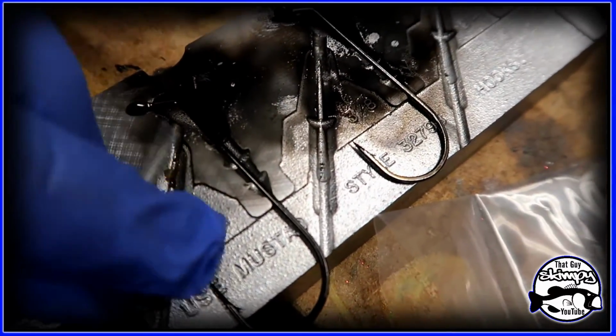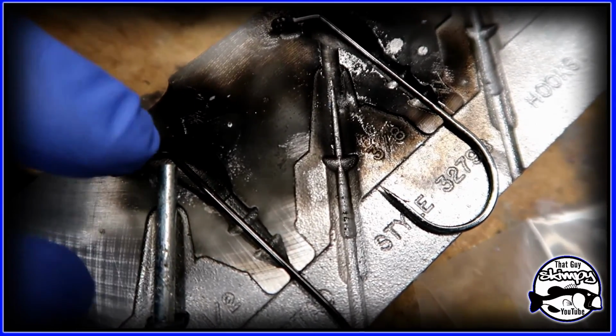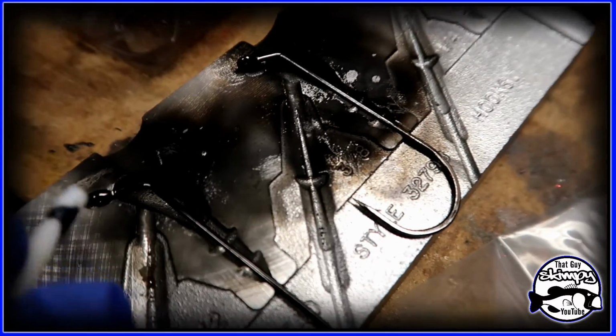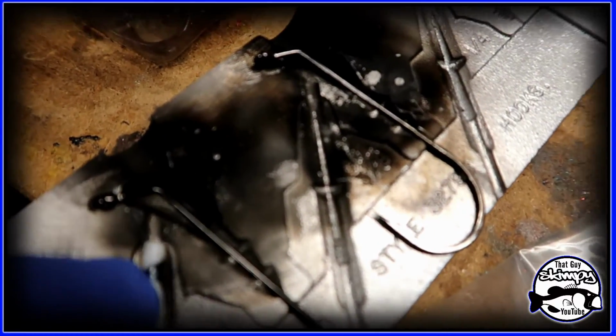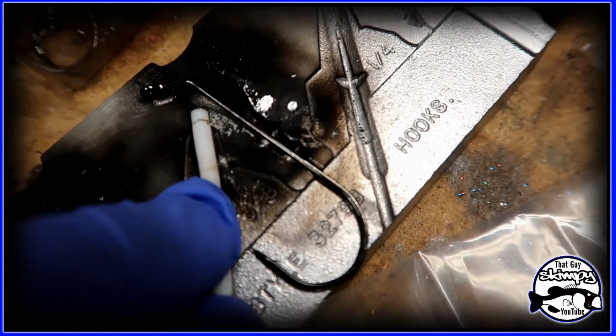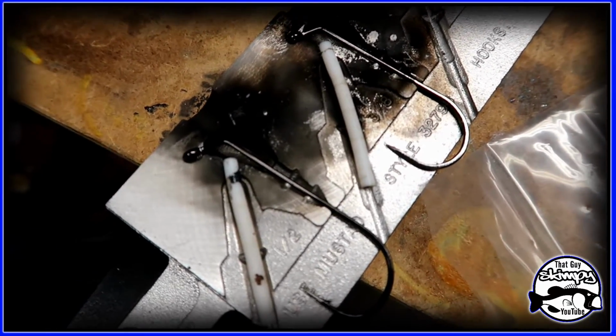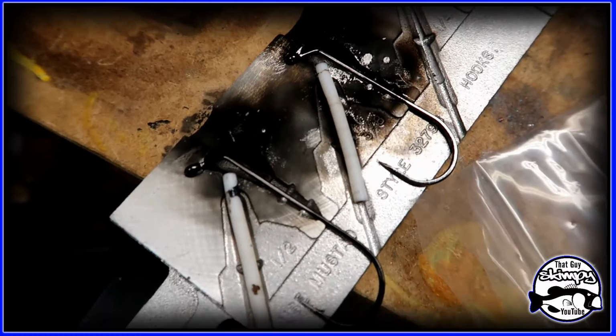You don't want to make it weedless, so if you put a pin in, it's going to go all the way into the jig, and it's going to make a hole to make it weedless. So we don't want to use that. We want to go ahead and use these Teflon pins, and you can slide it back. And what I do is I slide it right to the very end, so it's barely touching the head there, so it doesn't make a hole. And that's it. So that way it's not weedless. It's just going to be smooth. Okay, so let's pour these up.